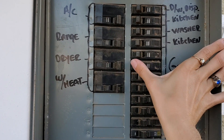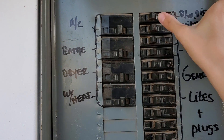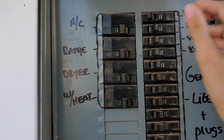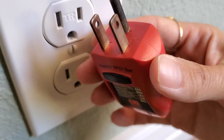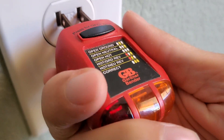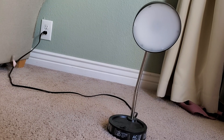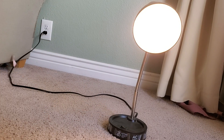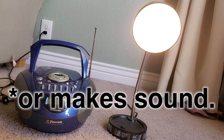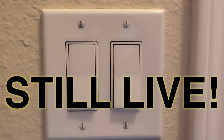When I did this years ago, I went through the entire electrical panel, shutting off each breaker and just going through each circuit individually. You can use one of these outlet testers to verify if an outlet is live — it's a handy tool to let you know if anything is wrong with the wiring of the outlet. But for the purposes of this video, anything that lights up will do to verify if an outlet is live. Of course, when you go through and turn lights and fans on, you'll have instant feedback. Once you map an outlet to a circuit, you have a few options.